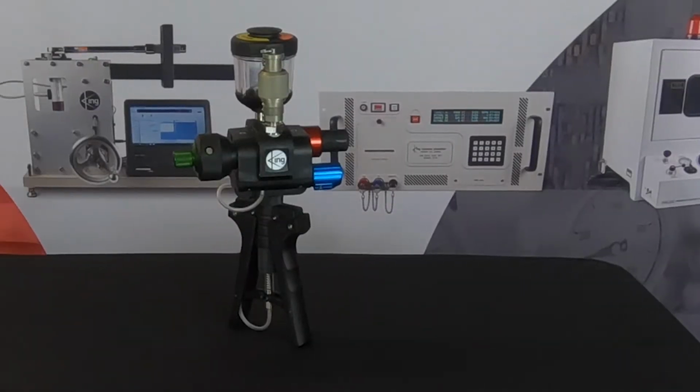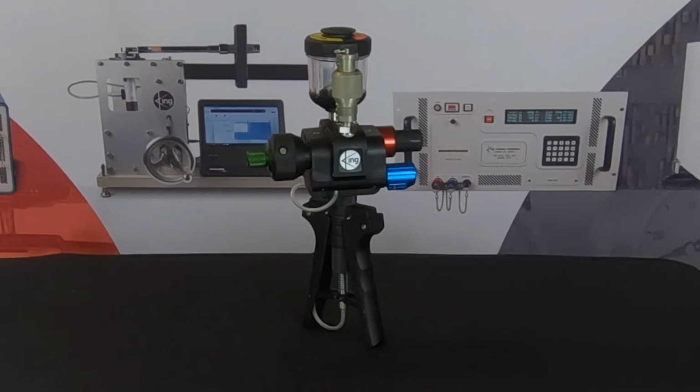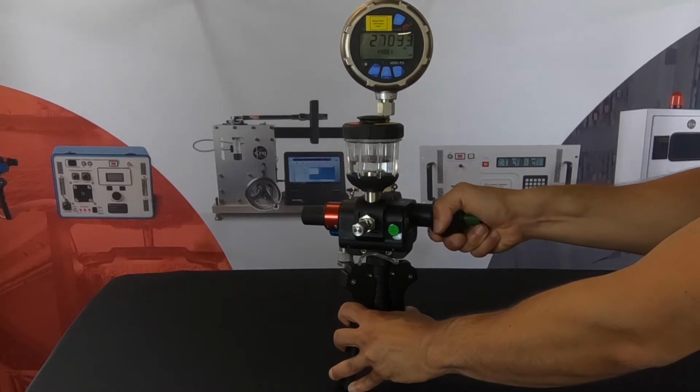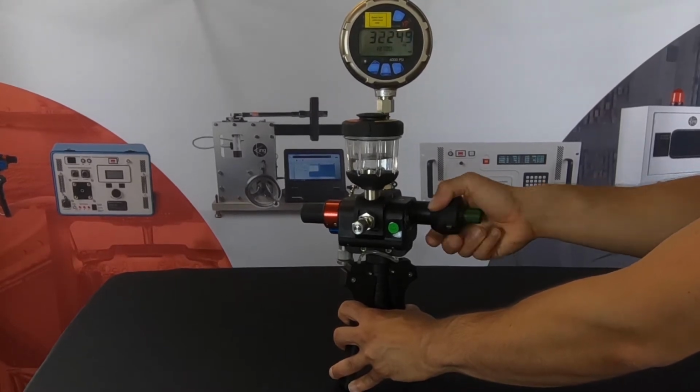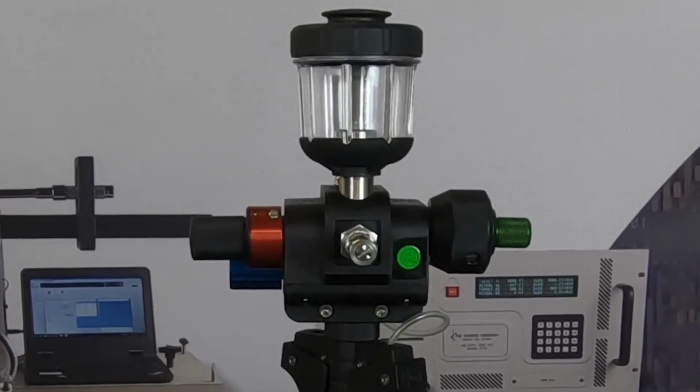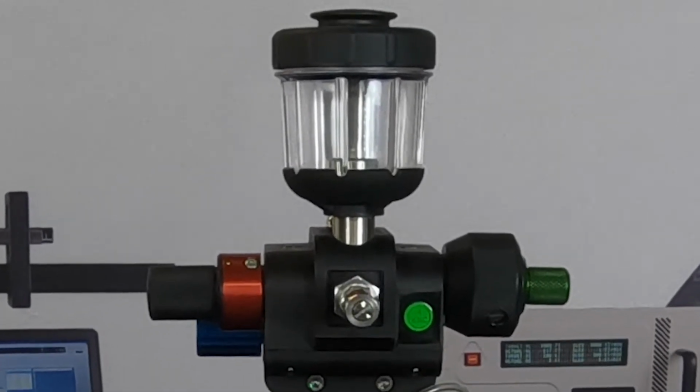The King Nutronics Model 3750 heavy-duty hand pump is a portable, self-contained pressure generator capable of producing and controlling calibration test pressures into pneumatic and hydraulic gauges. The hydraulic reservoir of the King Nutronics Model 3750 hand pump may be disassembled for cleaning using the following procedure.